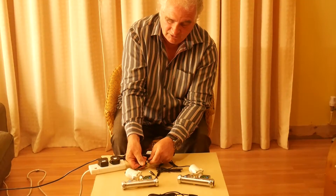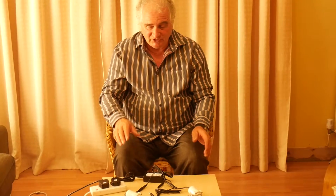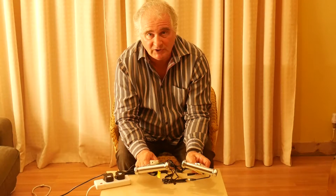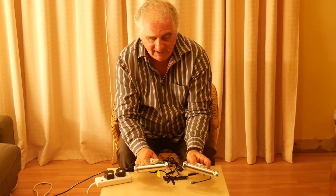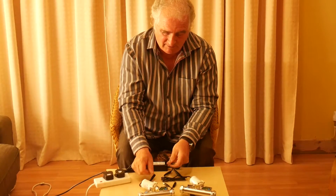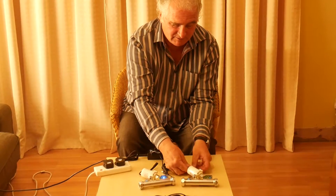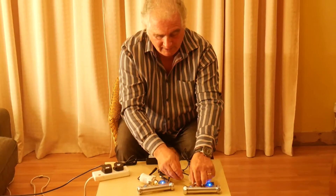This three-way, which powers up the two flow switches, can now power up the two pumps directly. This makes them run manually without the flow switches. So if there's air and not enough flow to trigger a flow switch, this should clear that air. It's a good idea to run the two pumps in manual mode when you first fit them, and then after you've cleared the air, plug the flow switches back in. The light comes on — that means you've wired it up correctly.